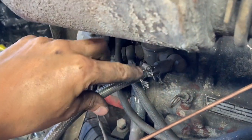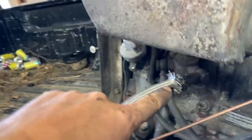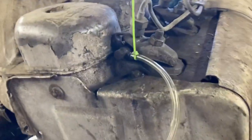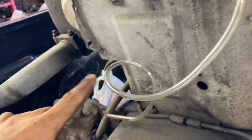Slap together this fuel system. This line is all frayed, but it's fine. That's pulling fuel from the can. It's the lift pump. Now supply it to the injection pump. It'll go over to the injectors through here. And then here's the return line, and that's where it returns.